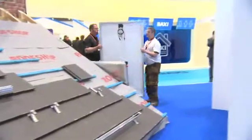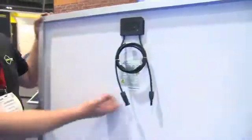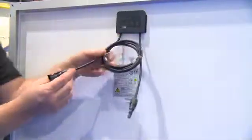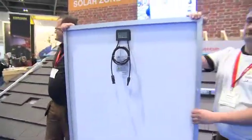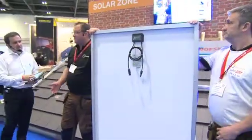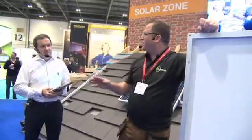At the back of the panel there's a simple junction box with two DC solar cables with proprietary connections — this is an MC4 connector, one of the most common weatherproof connections — positive and negative. Solar panels are mostly a very similar format, with a common dimension of approximately 1650mm by 990mm or so, so you get pretty quickly used to the routine of putting them on the roof. As long as you've got all the components and follow the manufacturing instructions, you don't need to be a neurosurgeon to do this.